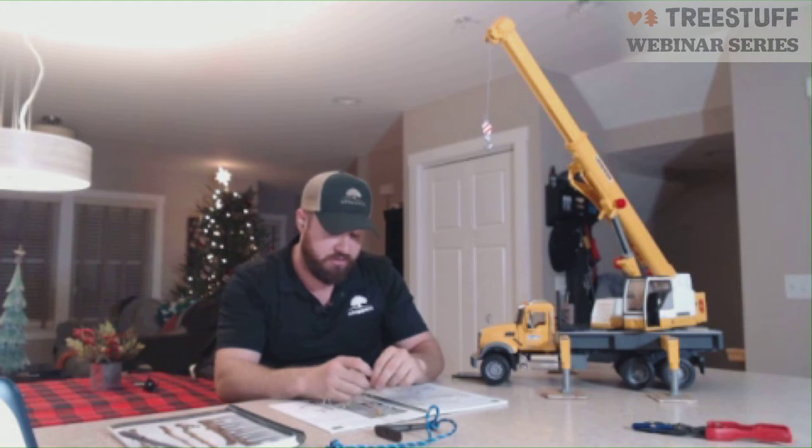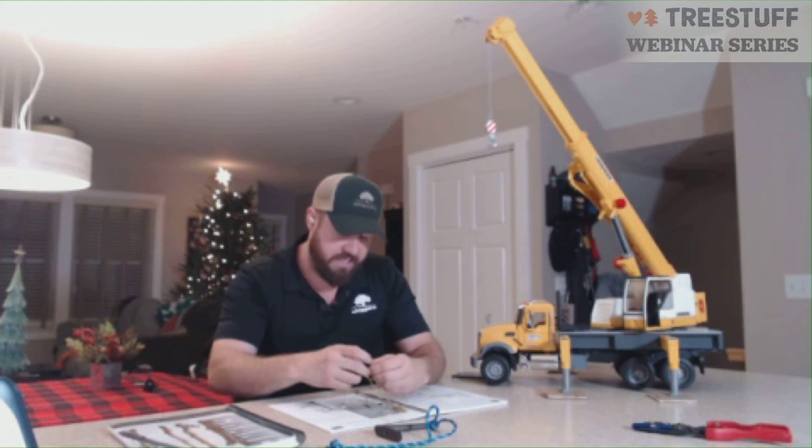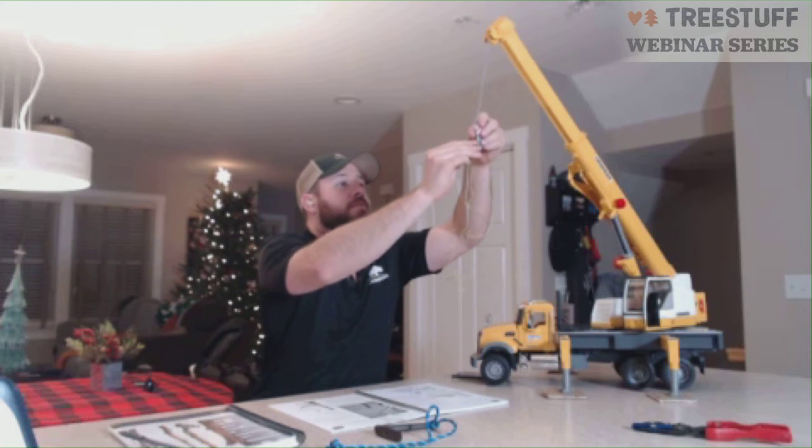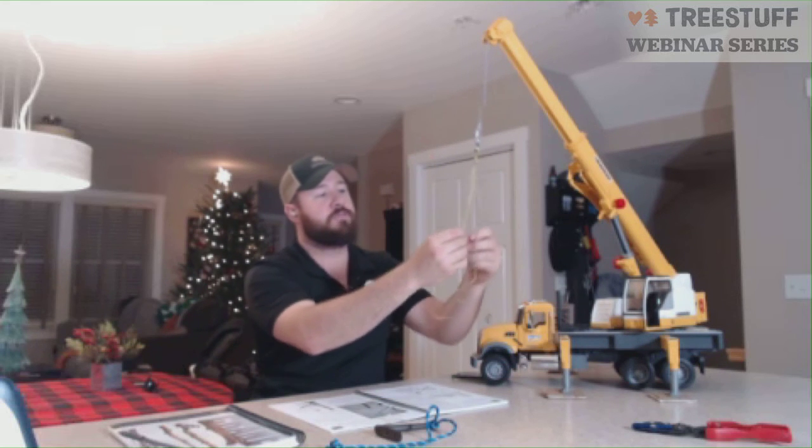The interesting thing about bridles is in dealing with capacities. When we hang our bridle off our crane, we have 4 independent legs here. When we attach these 4 independent legs, we're not gaining any capacity. Our 4 slings have the exact same rated capacity as that of 3 slings, due to the triangle principle of physics.